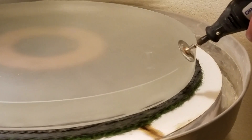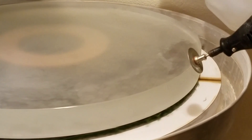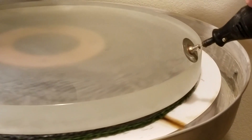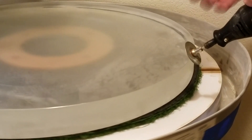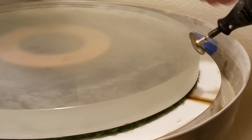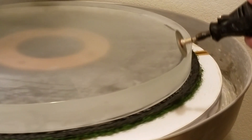Any time you do grinding with a diamond tool you want to be wet. Wetting down the surface and the tool increases the life of the tool through lubrication on the diamonds, and it also reduces dust in the air. You don't want to breathe the glass dust from grinding borosilicate — it's very hard on your lungs and can cause a disease you can die from with sufficient lung exposure. Any time you grind you should use a respiratory mask. I'm going to grind for just a minute so you can get an idea — it's obnoxiously loud but it won't take long.